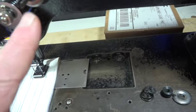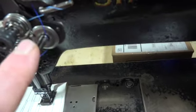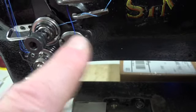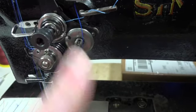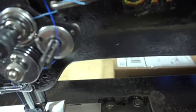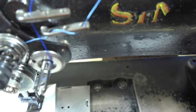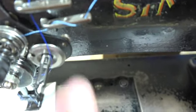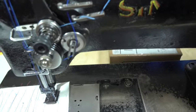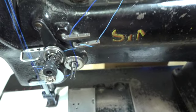They needed to knock off that cut. They cut it too deep into these tension regulators. And you could tell that because there's lint inside these discs. Okay? Because the thread is being ran across that milling, that cut right there in this stud. Okay. Again, not paying attention to detail, piss poor quality.